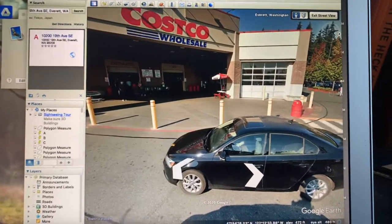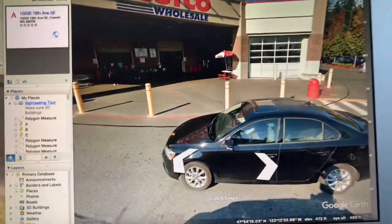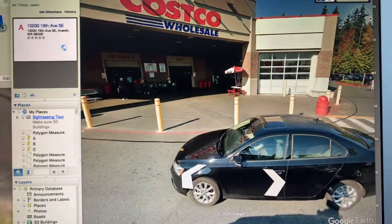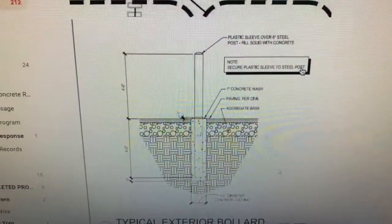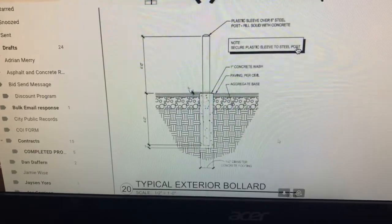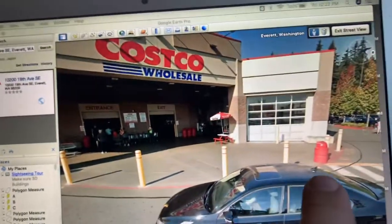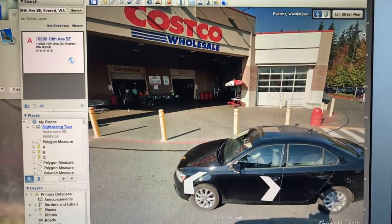To summarize: core drill, two bollard covers to order, and it's night work. Next week I'll go out and do a video, but they want a quick bid. The standard detail is a 12-inch diameter hole, core drilled 6 inches into the concrete, filled with bag mix, and a yellow bollard cover with two red stripes on top. We'll also need a gallon of red paint to touch up the fire lane. Any questions, let me know.